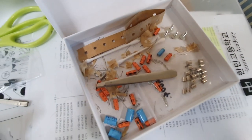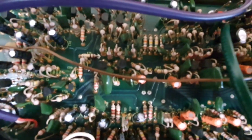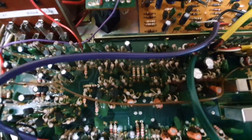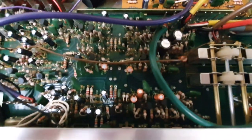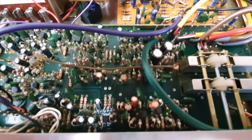I've already got most of them out. These are double-sided solder capacitors, so you have to be careful that you get enough solder into the joint to come through to the other side. I'll try and get a zoom in here. You can see on one of the capacitors I've replaced, there's a little solder poking through there. I'm going to show you the best way I found to get this unit recapped with no problems.